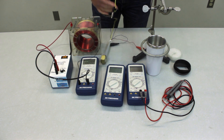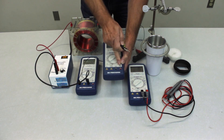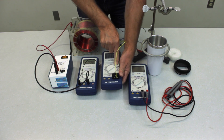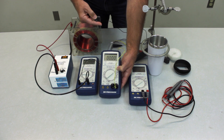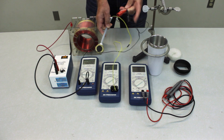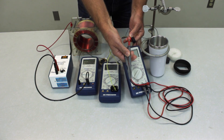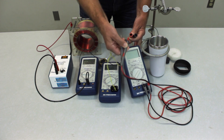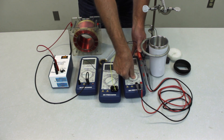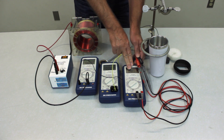For measuring the voltage on the sample, there is a pair of leads connected to a double banana plug — simply plug both connections into the common and voltage connections on the voltmeter. Set this to the 200 millivolt scale; it's important to have this set to get the extra precision. Finally, the other two connections on the sample are for the thermocouple. These are special-purpose connectors designed to receive the standard pointy probes from a multimeter — plug one probe into each socket. Set the thermocouple voltage also on the 200 millivolt scale.